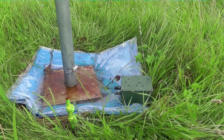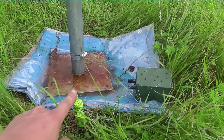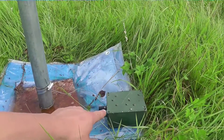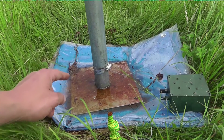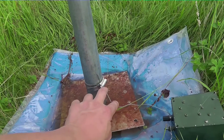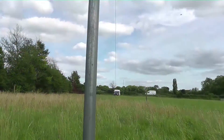Here's your close-up. So what I've got set up here — this is the far end, the resistor end; the balun is at the other end of the field. Essentially you've got your earth rod there. You've got the vertical radiating element, which is this steel pole here, and that connects to the ground via this resistor. I've got a piece of tarpaulin here just to insulate the mast from the ground because I don't want it earthing. So I've got a wire connected onto the mast, just clamped on here, into my resistor, out my resistor, into my earth rod. The radiating element is actually the mast itself, all the way up.